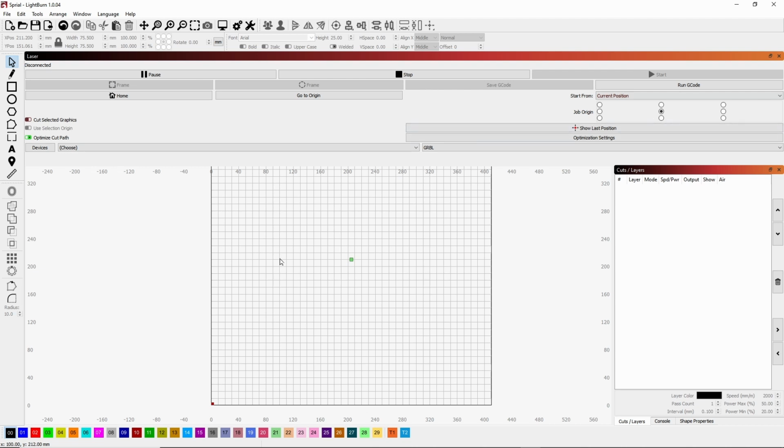So what that means is, wherever the laser engraver is when you open up Lightburn and go to burn something, wherever the laser is sitting, that is the center of your project. Now, I know you're saying, well, how do I know that my project is centered under the engraver? There's a real easy way to do that, and we'll show you that.